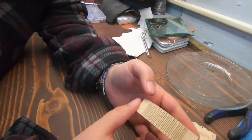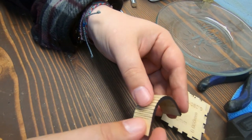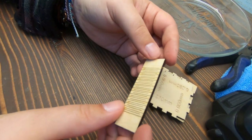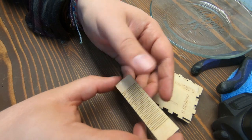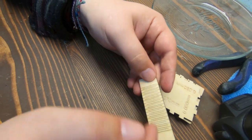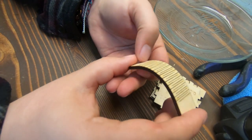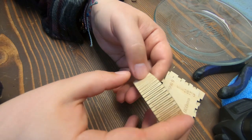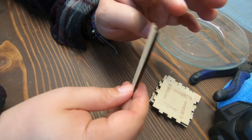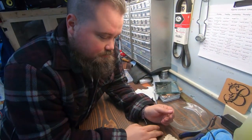Here we are with the flex piece. I did turn up the number of passes and sped it up — 600 millimeters a minute with eight passes — and it worked way better, just cleaner. I should have done the inside lines before the outside, just in case it fell out, because then it would have been unable to do the lines. So separate it like how I separated the numbers first and then the cutout: do the inside lines first, then the cutout. But it works great, the flexibility is awesome, and we'll be able to make anything we want with a nice curved top that bends down to close. We'll figure out something cool. That's all we have for this week — thanks for watching, see you next time.